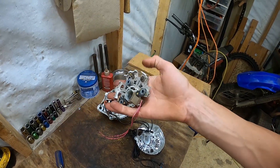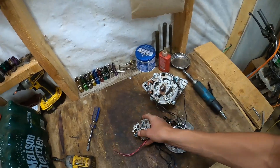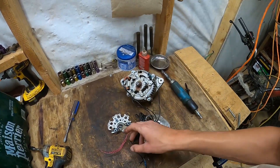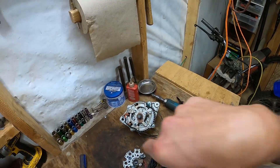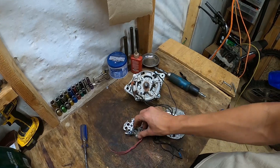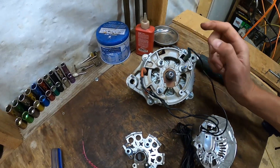What you do is take off the diode pack and cut all the diodes, because you do not need them. They're basically one-way check valves for electricity — they prevent electricity from going back in, only allowing it to flow out. Then you grab your three wires and connect them.